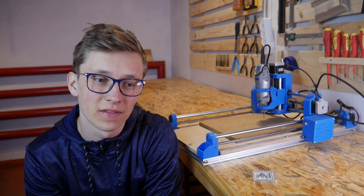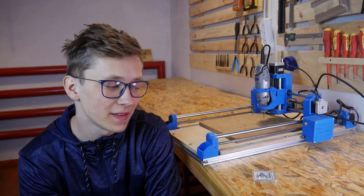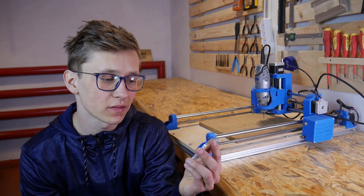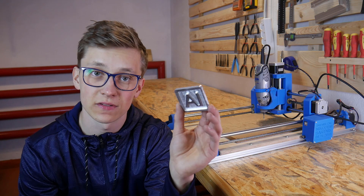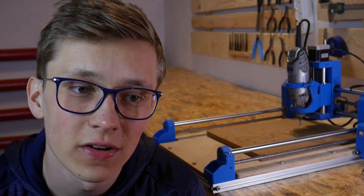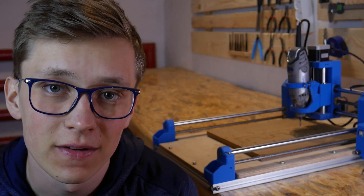This was supposed to be just an experiment to see if milling aluminum on a DIY Dremel CNC is even possible. A lot of people asked me to make this video, and I wanted to make it. I was a little bit afraid I would break the machine, but that wouldn't be a big deal because I can always print a new one. I was expecting a poor cut with low speed and bad surface finish, but I was wrong — the surface finish is really good. Those marks at the bottom are visible, but you can barely feel them with a finger. I ended up cutting it two times faster than I initially wanted to, and I could easily go 0.3mm, maybe even 0.4mm deep. I got this result at the first try, so it's really not hard. Milling aluminum on a 3D printed CNC — I never thought something like this was possible. But it is, and you can do it yourself for about $300, that's the cost of building this machine. In my next video, I wanted to replace the Dremel with a 400-watt spindle, but Dremel works so well with aluminum that I think I will play a little bit more with it. I will try to make some injection molds in my next video, so make sure to subscribe. Thank you very much for watching, happy making, bye.